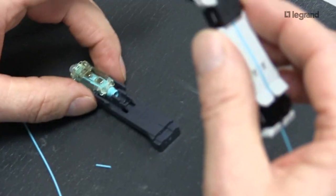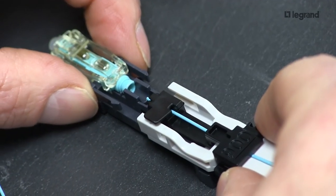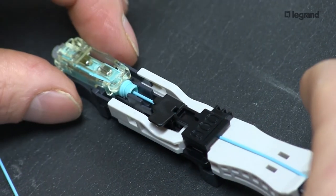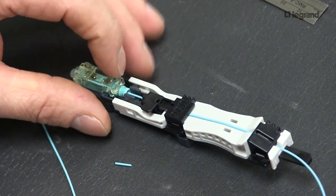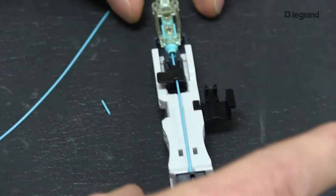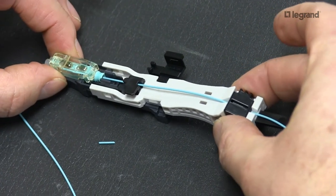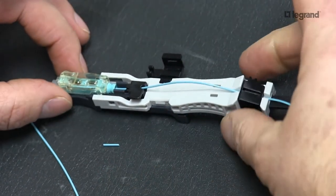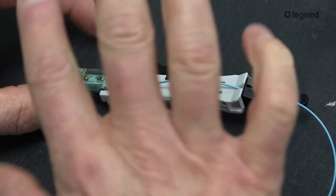I'm ready to terminate. This holder just slides on top of the jig, so use your eyes to make sure you slide it in properly. I'm going to slide it together to what I call a soft stop — right there. At this point, I'm going to open up the second gate. Notice where my hands are — I hold the whole assembly together, my fiber and my tools, so everything stays in place. Once I open that second gate, I move my hands to the outsides again and continue sliding together. You'll hear a click. There's your click. Right here you have positive pressure going forward — see the bow of your fiber? That is exactly what you want to see. Just tap it; you don't have to hit it hard. Just make sure you have that positive pressure and you're seated properly into your connector.